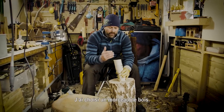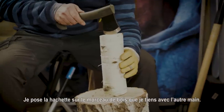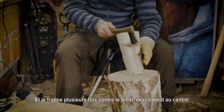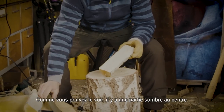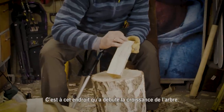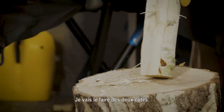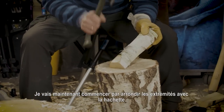I've selected a piece of wood with the right diameter to create a coffee scoop. I put the axe on the wood and with my hand I hold the tree trunk, and I just hit a few times exactly in the middle — and there it opens. As you can see, here is the darker bit; it's the part where the tree started to grow. Exactly that part you want to get out. Flatten it out. I'm going to do this for both sides, first rounding the ends with the axe.